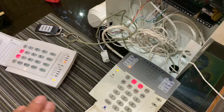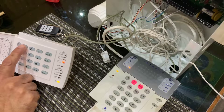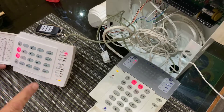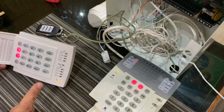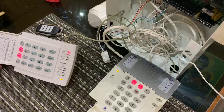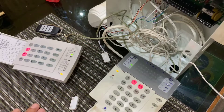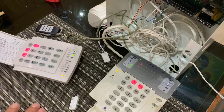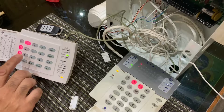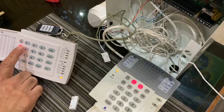The K35 is muted at the moment so as not to confuse us about where the sound is coming from. Let's see what happens when I arm the system — I'm going to put my code: 1, 2, 3, 4. It starts counting down and you can see it's beeping from beginning to end, all the way through the last 10 seconds. Now the system is armed in stay mode. When I open the door it starts giving me the entry delay — you hear the keypad is beeping.